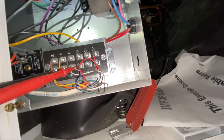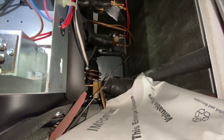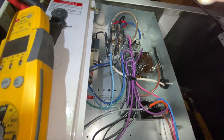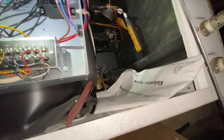The unit shut off. Terminal number seven is our lockout signal — if we're getting 24 volts from there, that means the lockout relay has engaged, which it is. Something is causing it to lock out. We're receiving the call from the thermostat, so the anti-recycle delay is delaying the startup. Right now we have no voltage from number seven, so we're just waiting for the delay timer and then we should get the compressor.